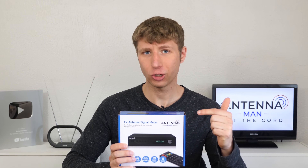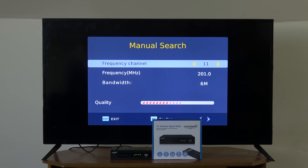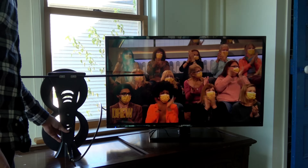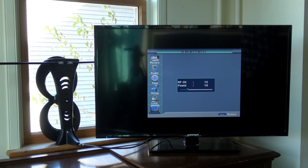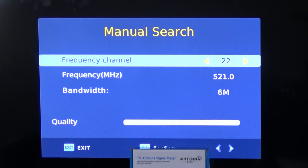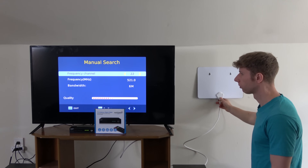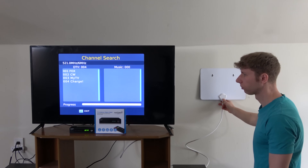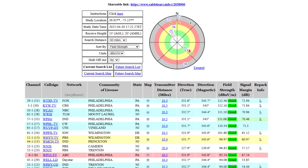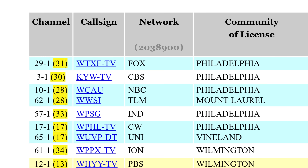An extremely useful feature on my signal meter is the manual search. It lets you manually add a TV station that doesn't show up on a channel scan by setting the RF channel, which is a lot easier than blindly moving the antenna around, running endless re-scans, and hoping for the best. For example, let's say my local Fox channel was not picked up on a channel scan. Press the menu button on the remote, scroll over to the channel search menu, select manual search, set the frequency channel to 22 — which is the RF channel of Fox in my area — move the antenna around until dots are shown representing a signal coming through, and then press OK to add the channel. You can find the RF channels of TV stations in your area by running a reception report on rabbitears.info and looking at the channel number in parentheses.